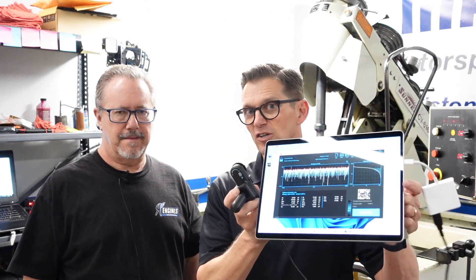The key is using the correct tools. We have the surface system, the profilometer, and the microscope — and Bob uses both the profilometer and the microscope every day on every block. The only way you can know what you're doing is to check it. If you can't check it, you're guessing — and we don't guess. Bob learned this the modern way, not the old way of going within a thousandth and doing it by feel.